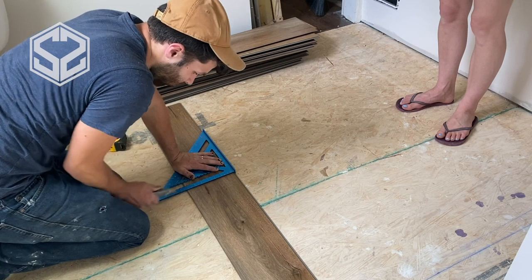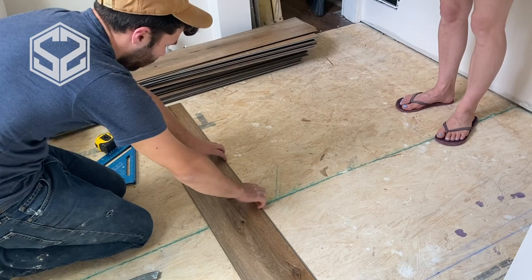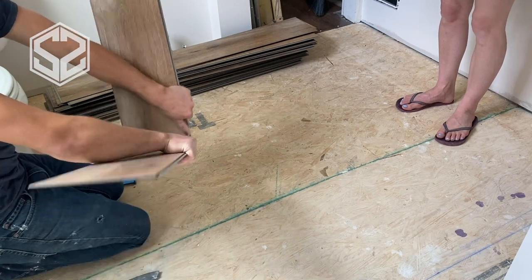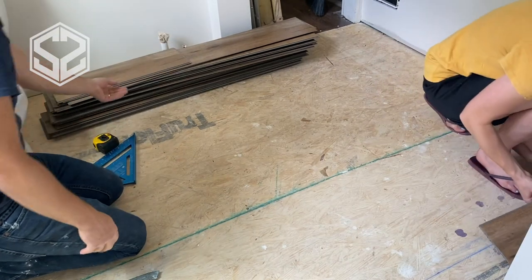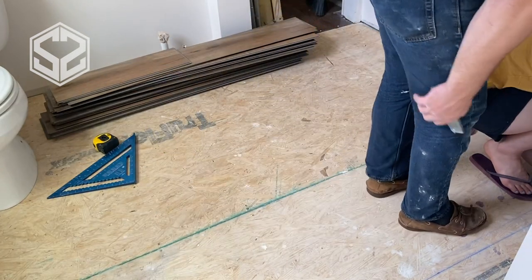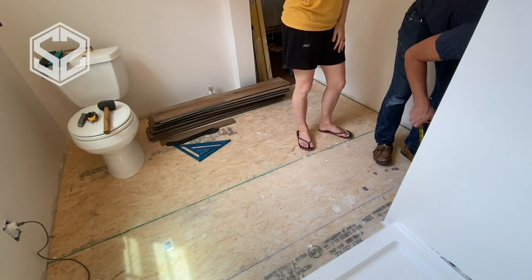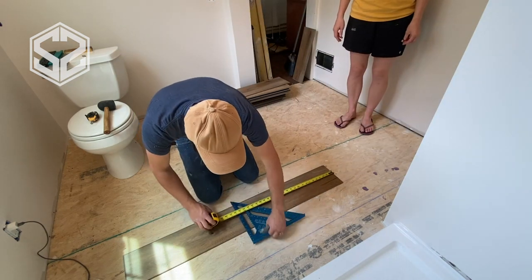Now I'm going to make my first cut of this flooring and I'm just using a utility knife. You want to use a nice sharp blade and just score through the board, and now you can easily break that in half. All the vinyl plastic on top underneath the wood texture breaks nice and smoothly, then it's just the foam underneath. If you bend it back and forth a little bit, you can easily tear that off and have a nice clean cut. In order to make a perfectly square cut, you can use one of these speed squares — hold that down on top of the board and just run your blade right along that and you'll get a perfectly straight cut every single time.